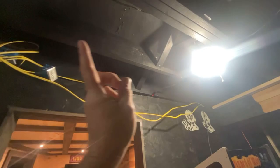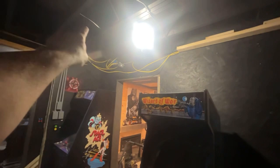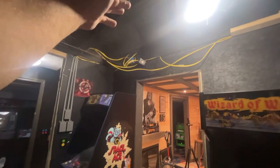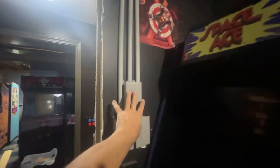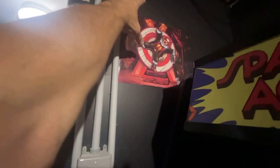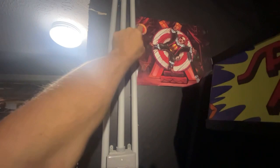Now I'm going to put blocking along this wall and put the 2x4 down this wall and then down that wall. Then we'll be ready to put the two centers. I've got to measure if we're going to have 9 tiles total or 6 tiles total. I'm getting around the corner here. I probably should have explained why all these wires are hanging down — I had them all strapped up on the joists up there. I pulled them all down because I'm going to reroute them and put that junction box in. I'm going to put four switches right up here in the wall — I'll have to cut a channel through the drywall and put a four-gang box right here. That's going to power the games in this room and two other sets of circuits for out there. And the fourth switch is going to be either a fan or lighting in here.